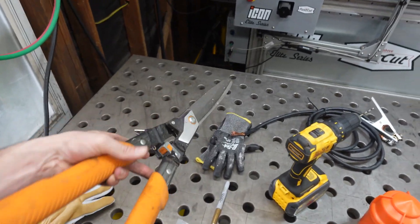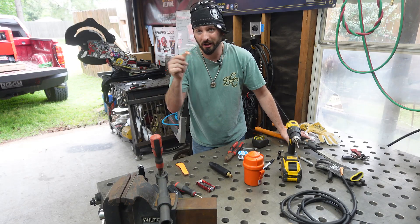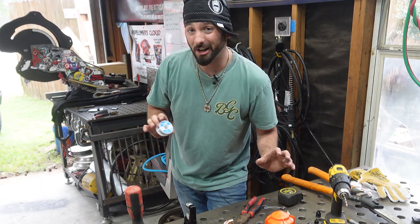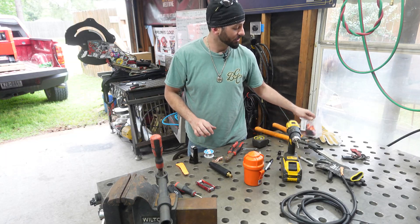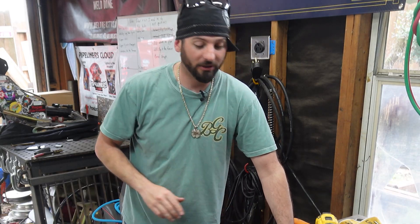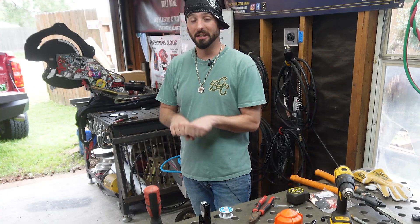We've got the leads on the ground. We're basically going to cut the ends off — I've got some loppers here which do the job pretty okay. We'll use a box cutter to strip back the cable enough to put our lugs on. We've got a couple of these lugs for some 4-0 cable. Once they're on, we'll take our hammer lug and crimp them onto the cable. After that — the optional step — we're going to pour some electrical flux and solder, heat it up, and give it an even better bind. Then we'll put some shrink wrap around the edge. We'll also need to drill into the lugs a bit because the holes are too small. On the opposite end, we put on the female LC-40s so we can hook up our stinger, our TIG rig, or our ground to either the positive or negative.